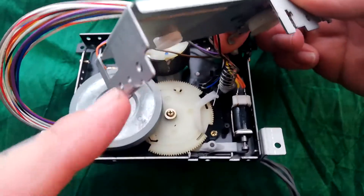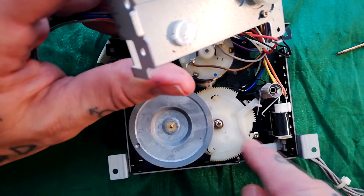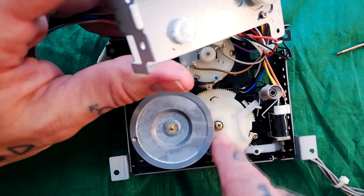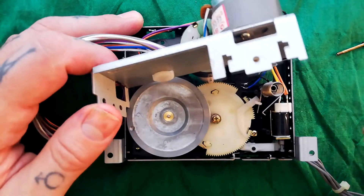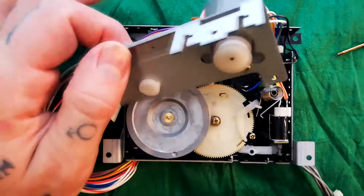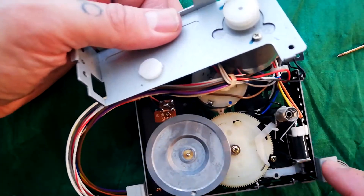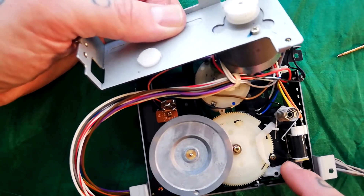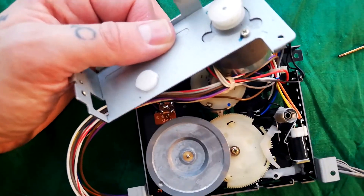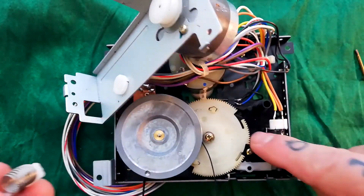There's a little tab into the space from this side, so when you move that out of the way you'll see something like this. That little arm, held under tension by this spring, will be sitting on top of this big cog-cam gear. When it goes back on, you'll need to get the arm and spring to hook back under there. The retraction and lowering of the head and fast-forward/rewind must be controlled by this solenoid here — a gear arm changing the gears powered by this flywheel, which is powered by the capstan motor — and that's raising and lowering the head and changing the reel mechanism position.